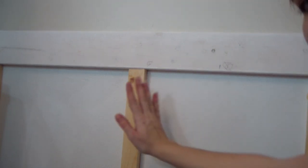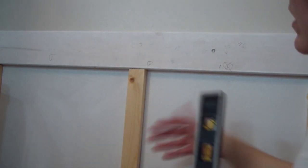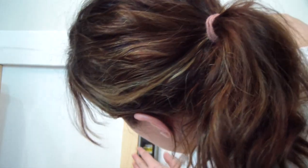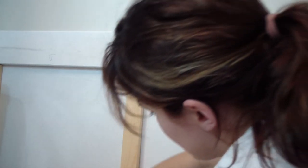I've decided to go with a 14-inch gap between each one by two. All I'm doing is leveling up and squaring off this last board — I apply liquid nails on the back so you do need to work fairly quickly, then put the level up beside it and check it on a couple of different angles, both top and bottom, to make sure it's perfectly level. What's left to do is fill in the holes from the brad nails, finish with one or two final coats of paint depending on how many it takes to make a solid color, and then go around with the caulking.